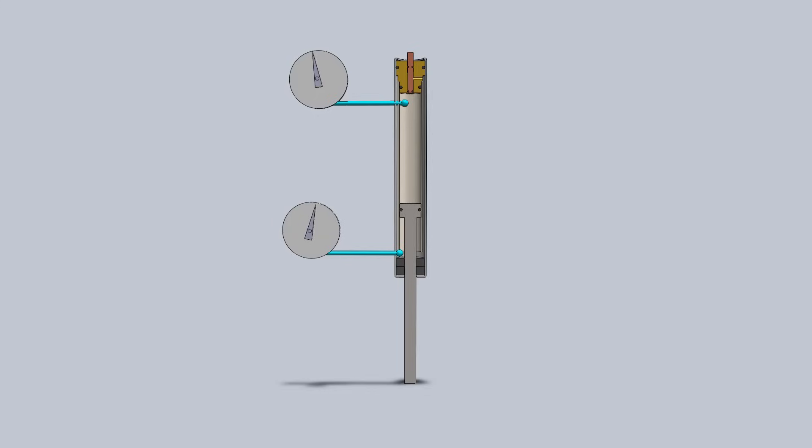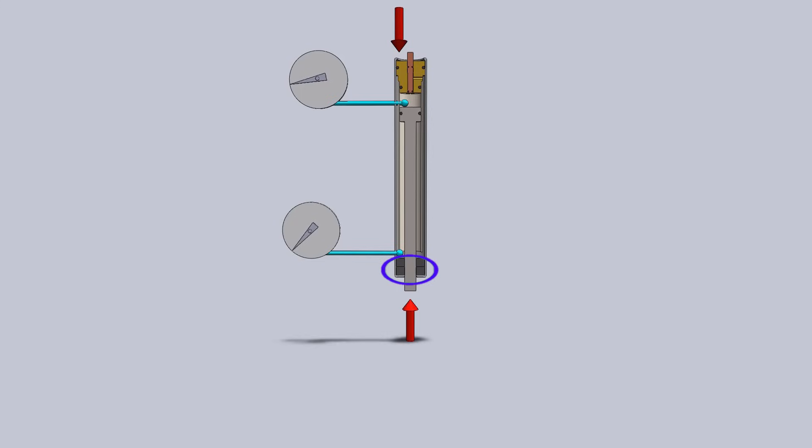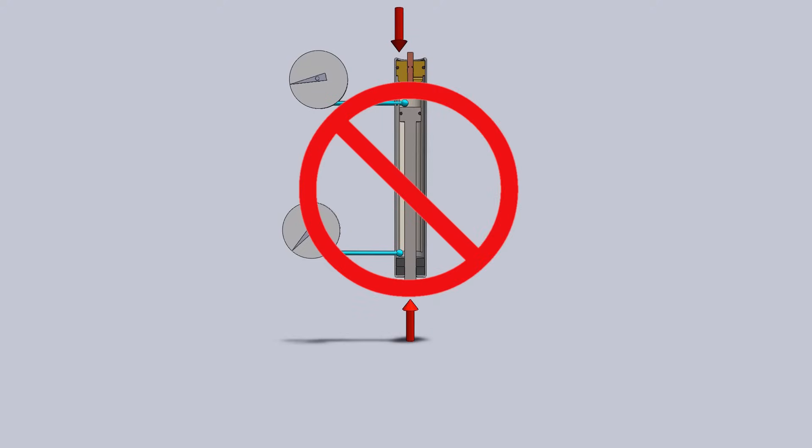The pressure of the gas is critical. If the pressure is too low, the chair will not support your weight at all — it will just immediately drop to the bottom position when you sit on it. The gas can leak out through the support shaft seals or the valve outer seal. If this happens, you have no choice but to replace the cylinder.